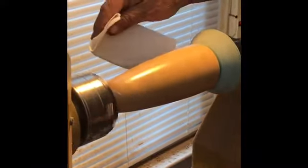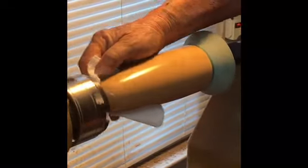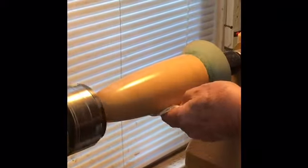So now we're going to take a paper towel and wipe this super glue completely off. I don't want any super glue on the surface of my product. All I'm trying to do is infuse the wood with the super glue. Slow that down, and again I'm going to do my random orbit, and you'll notice that it's not smoking, it's not sticking. I've got plenty of time here. This super glue has a 40-second time delay before it starts to polymerize, so we can completely work with it.